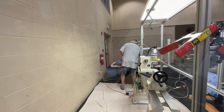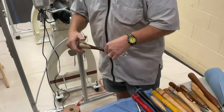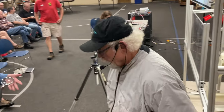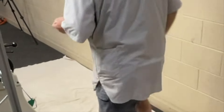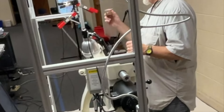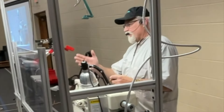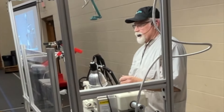This is a cautionary word: make sure you use the right drill. There's also a difference if you're using softwoods versus hardwoods, because hardwoods may require you to use a slightly larger drill bit. Those details are mentioned in the instructions that come with most of these kits. The approach I'm using for the stopper is very similar to what I use on handles — magnifying glasses, letter openers, pizza cutters, pie servers — same approach.